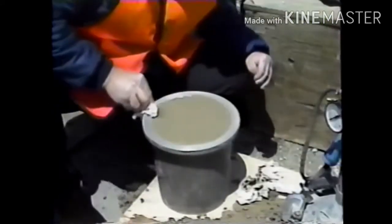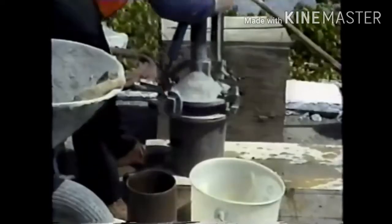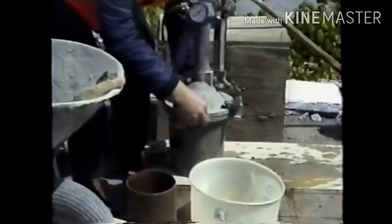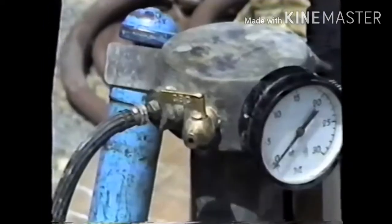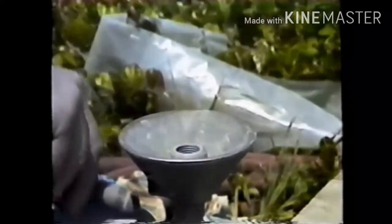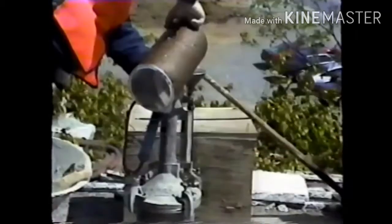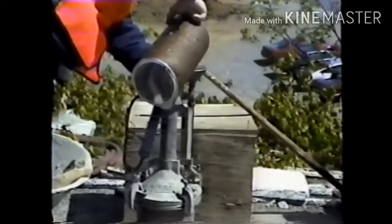Then, the contact surfaces are wiped clean and the cover assembly is clamped firmly to the bowl. The lower petcock is closed. The upper petcock and funnel valve are opened. And water is added until it rises to about the halfway mark in the standpipe.